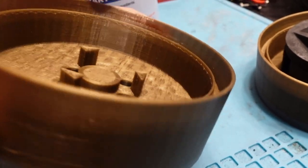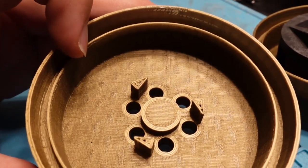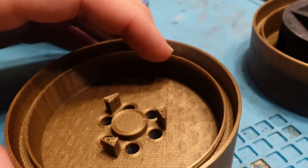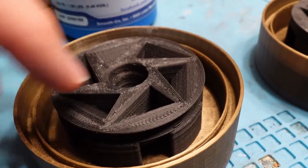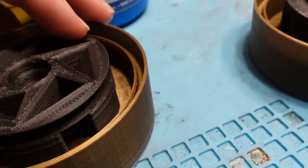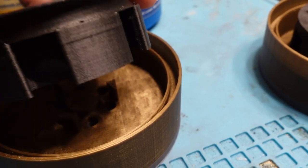The way I designed this mold, there's an extra lip up top — the tire will only come up to this lip here. This extra is just in case I pour too much resin, and I added this little channel groove to help take up some spillover. My goal is to fill it just barely to the tire line. If it spills over a little bit into that trough, that's okay — I can just peel that away separately because there's a sharp edge which makes it really easy to peel the rubber off afterwards.